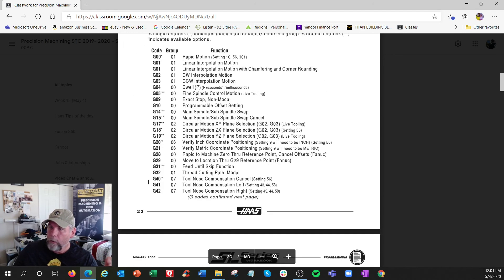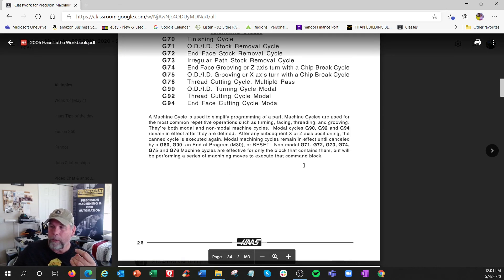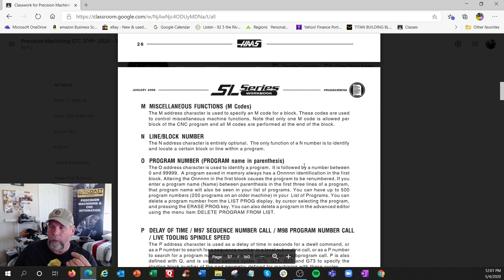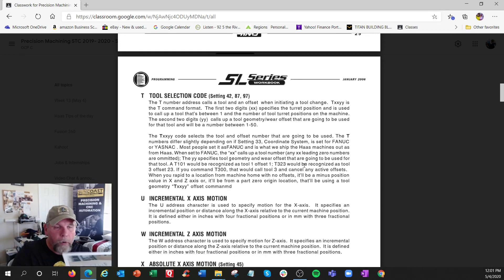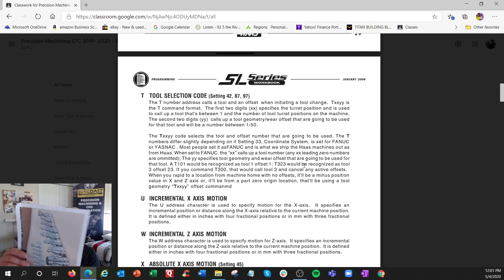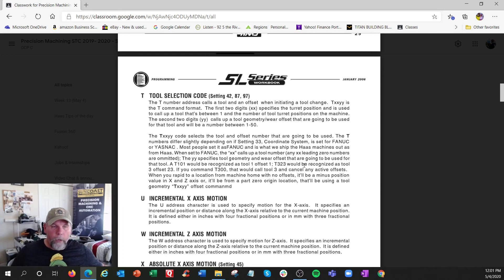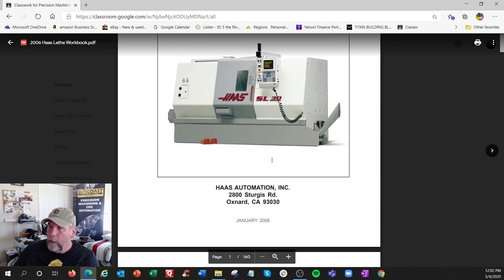So that's rough, finish, drill - pretty standard. Lathe manual programming is actually pretty simple and you can make a lot of parts without going to CAM. You probably couldn't make fancy lathe parts like a chess set without Fusion, but if you have the coordinates of the profile because you're reading the print, that's really how it gets machined. The NIMS lathe project is manually programmed and honestly it's very easy.